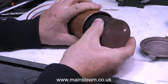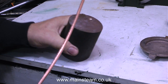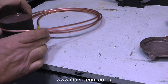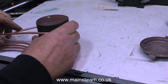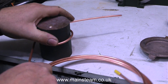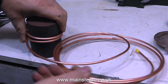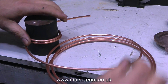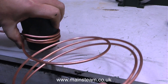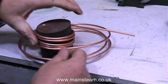Once the copper tube is perfectly square at both ends, it's time to bend the coil. For this job I'm using a piece of steel bar that I found in my box of steel bar bits. You could use a piece of tube, but whichever method you use, the piece you're winding around needs to be 3/8 of an inch less than the copper tube you're using for the barrel. The copper pipe is 3/16 of an inch in diameter, and in imperial measurement 3/16 is half of 3/8.